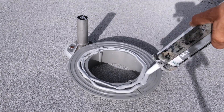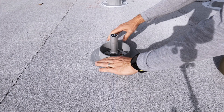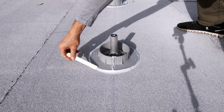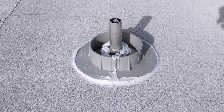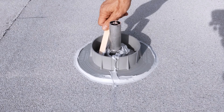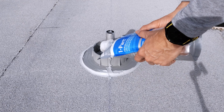Next, we take the e-curb and put a bead of Chemlink M1 sealant around the bottom of the flange — that provides one element of the waterproofing seal. We finish the outside of the flange with a bead of sealant as well. The Cubase base plate and post need to be covered in Chemlink sealant too, which helps the one-part pourable sealant adhere to it, because the pourable sealant doesn't stick to metal — it sticks to the Chemlink M1. The curb then gets filled to the rim with the one-part pourable sealer.